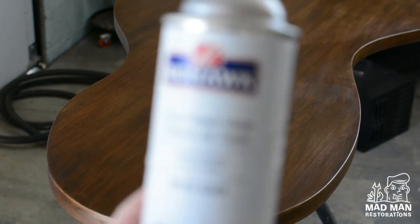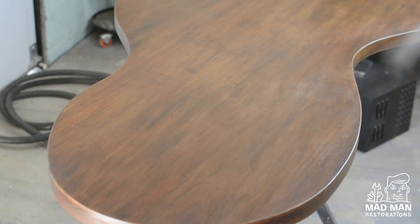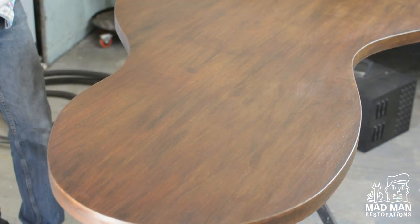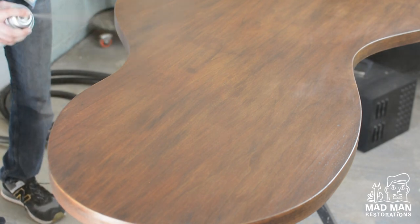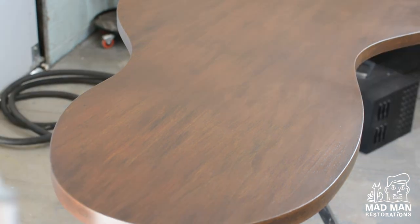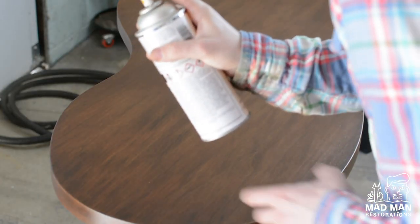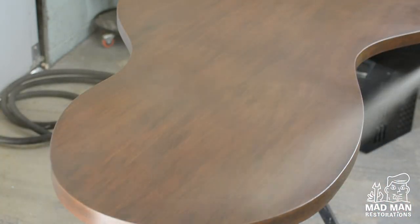After at least 30 minutes, now it's time to use toner. I'm using Mohawk Perfect Brown tone finish toner, and I brought the piece inside because when spraying toner out of a can it's essentially like spraying dust and any sort of breeze will totally affect the way it's sprayed on the table. Then I like to use Amber Ultra Classic toner — I like to use this especially with more dark brown pieces because it gives it a nice little amber glow.